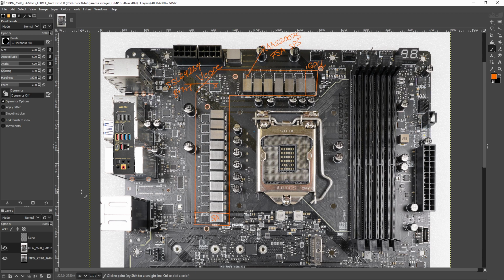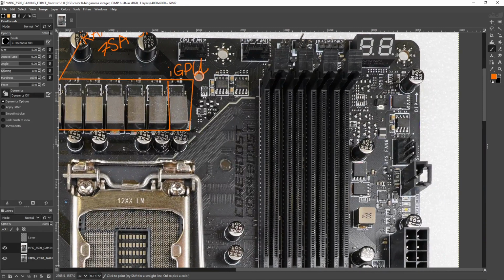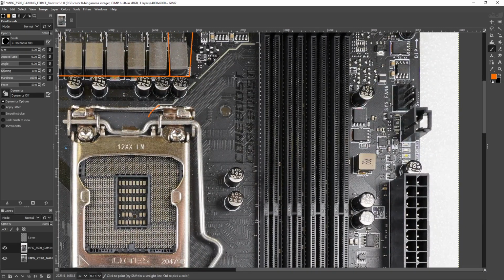And they replaced the 90 amp power stages with 75 amp power stages, but in the actual real world operating range where you'd be running these power stages, it still doesn't make a difference. This is why, from 70 amps to 100 amps, the smart power stages all have very similar performance curves. So it's just like having a motherboard with 90 amp parts or 75 amp parts, it doesn't really make much of a difference. So yeah, very, very solid VRM here from MSI. And yeah, let's move on to the memory section, I guess.